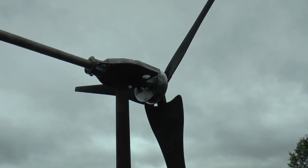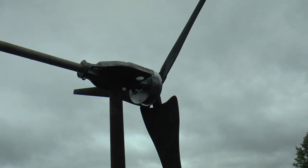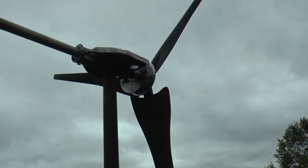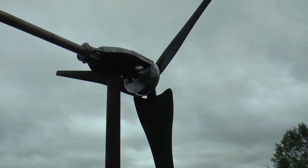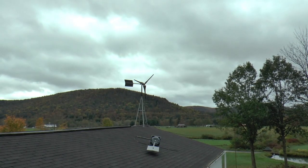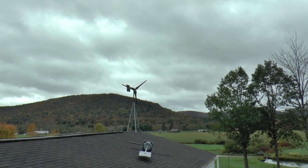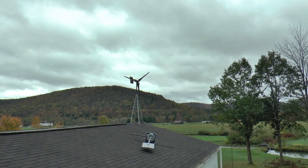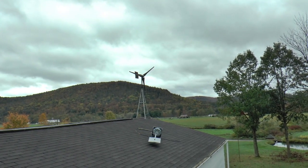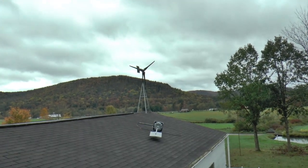So that was a quick one, and it does actually make a little. That's more than the other ones did at 48 volts. But I think we're gonna hook these onto a small 12 volt system. And by the way, that's got the coils that I rewound for the tryout on the water turbine. The original hoverboard ones work, but these work better.